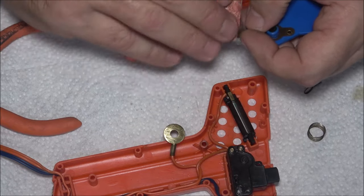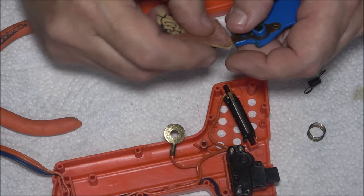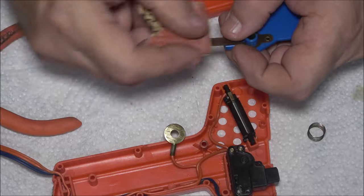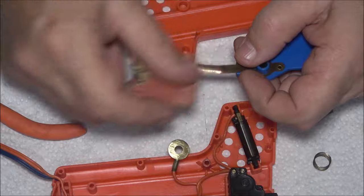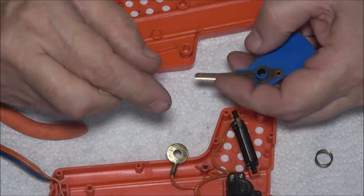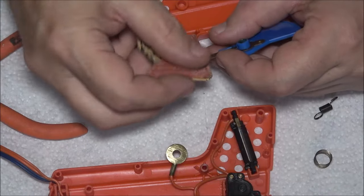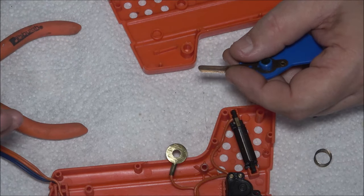That's looking pretty good, it's not rough. I also found this spring set. I've got to go ahead and get them out here. On the end of the trigger there's supposed to be a hook — like a little plastic hook — where you hook a spring onto it. I think that's what happened to mine. My thought is to drill a little hole in there, put this hook in and bring it over to that. I think that'll work.